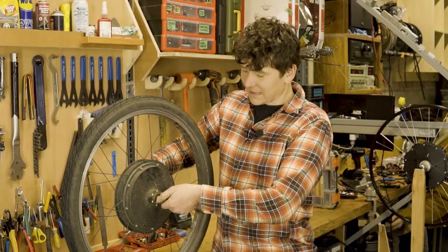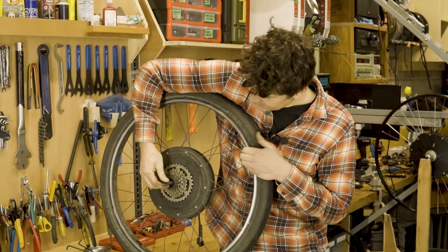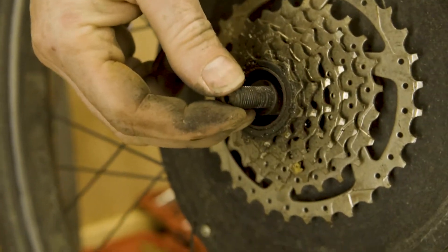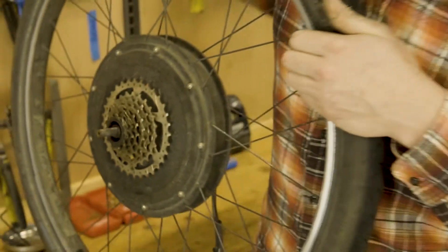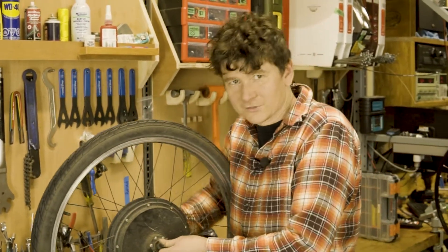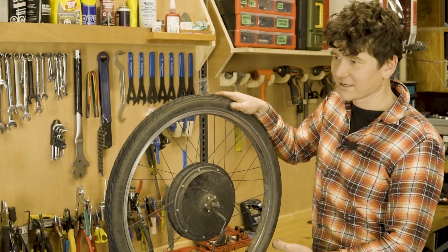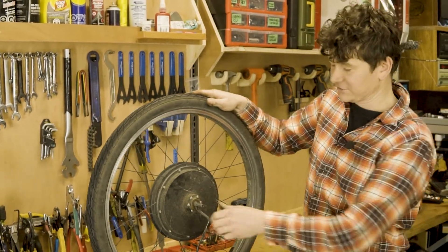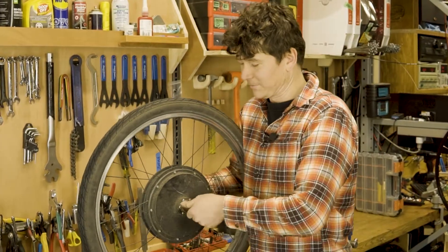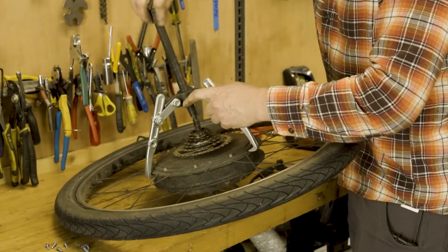At this point the axle you can spin by hand, but it feels really super rough and there's even a little bit of play — you can see it wiggle back and forth. Most likely we have a shot ball bearing on the right side plate here, and that's the source of the roughness and the sounds. Sometimes you'll spin the axle and feel zones where it's really stiff, which can be a sign of rust buildup inside the motor. But I don't feel anything like that here, so I think when we open it up we'll find some little pools of water but hopefully not a big thick pasty rust material.